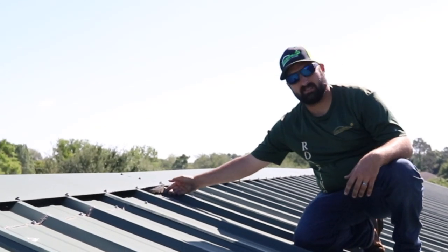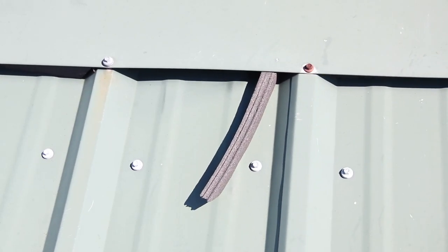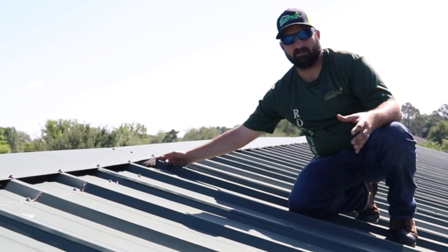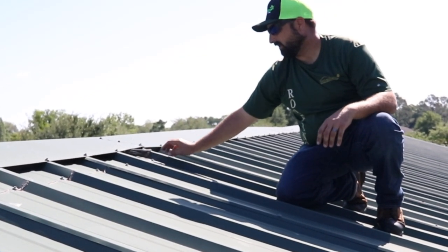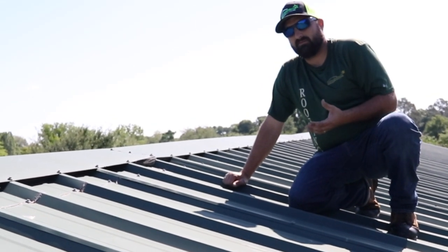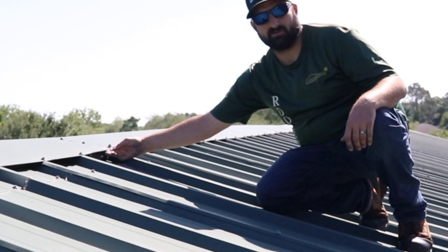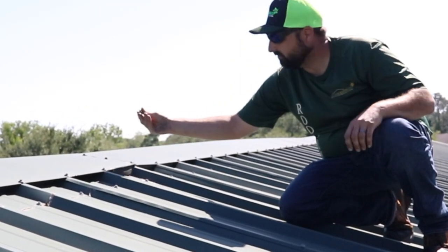The foam here is to protect you from getting insects, bats, rodents, and wind-blown rain in the building — and it's not doing its job. It's already come loose. Those need to be put on with a sealant or tucked underneath further where they can't come loose. Again, the cap is loose — they used the wrong fastener for a cap on a metal roof. Look, it comes right out with a turn of the hand.